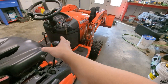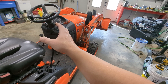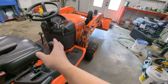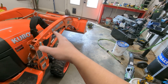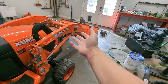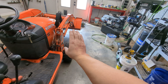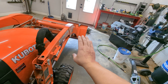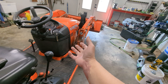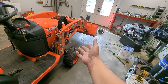So that's the secret to Kubota's two-function capability. It has nothing to do with the fact that other tractor manufacturers are putting in an inferior valve. Technically I would say this is an inferior valve, but in this case it gets superior results in a lot of scenarios. One scenario: you're running dirt from one place to the next. You're going to have a whole lot more flow to use as you come back to your dirt pile and want to realign to get a new bucket. You basically have double the flow that the others have, and because it's being reused, you can be faster and more effective.